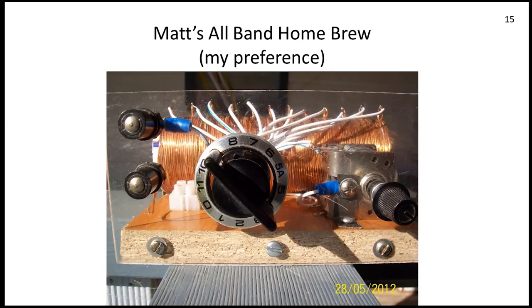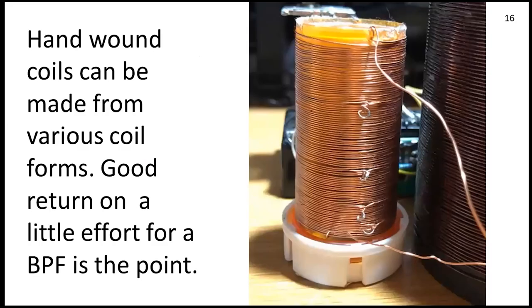Here's one of my hand-wound coils — I haven't found a use for it yet, but I will. You need to put some hardware between the dongle circuitry and that big 40-meter dipole. My first SDR Pi program halted each time I touched the whip antenna — people aren't necessarily putting their fingers on the input of a TV dongle, but I did on that one.